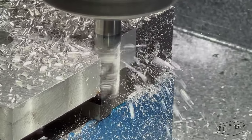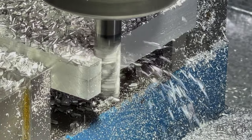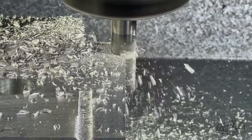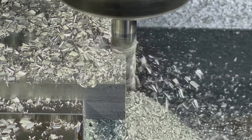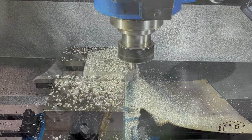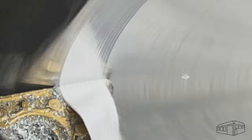I cut a section of aluminium off a previously machined NT30 tooling holder which I no longer use. I machine it to size in the mill before facing it in the Colchester. One side has a relief to fit the motor flange and the other side has a stub to locate the aluminium pulley on the back of the lathe.